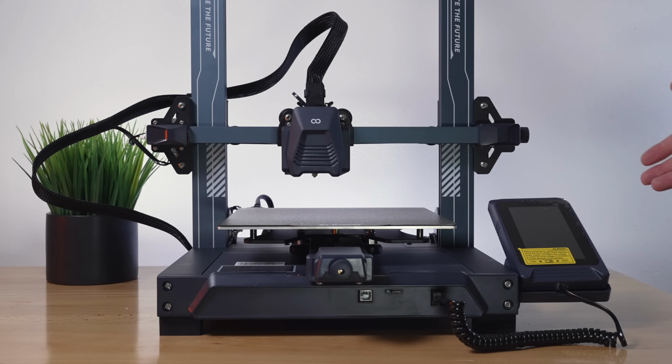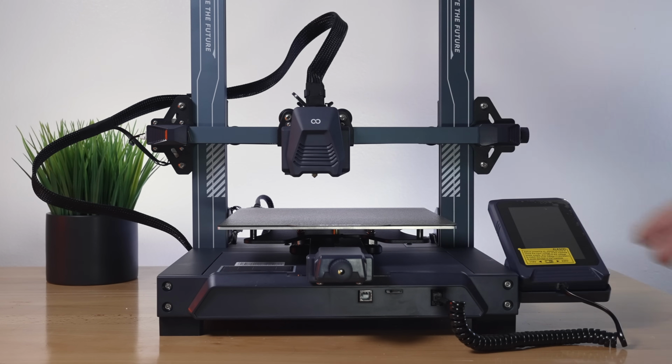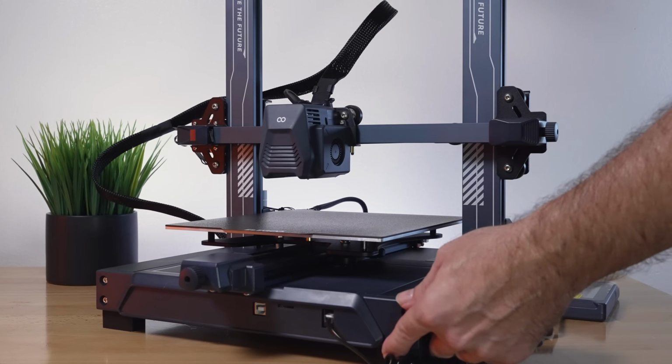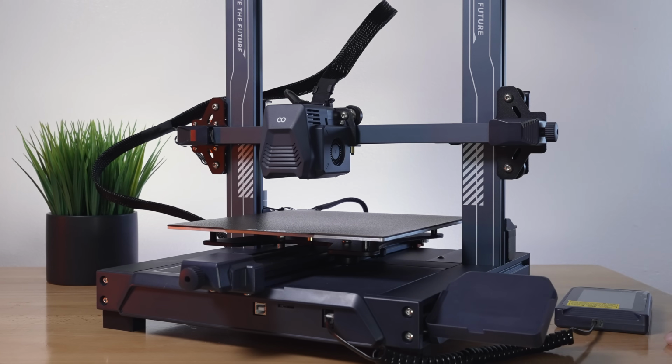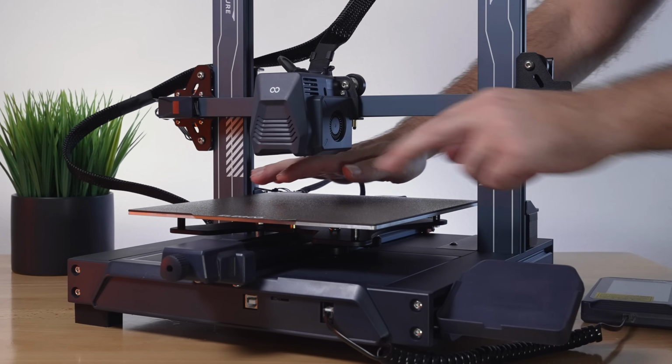And so for the next part, we need to look at the rollers and adjust if needed, and also check our belts and tensions on that. So we'll start here with the bed. This might have been easier to do before installing everything, if you'd prefer to do that, but you can easily reach it here. But what's going on here is that we got 2 rollers on each side. We got 2 stationary and then 2 adjustable.